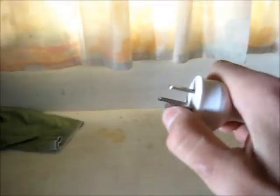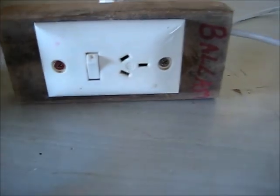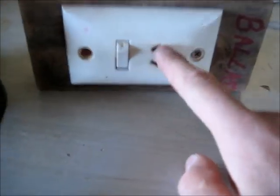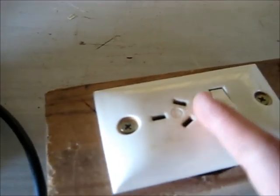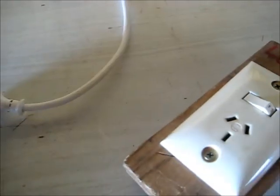All the ballast is, it's just two power points wired together in series. So I've got an active that goes through to my load, or through to my ballast. Active goes in here from your supply, out through your load, back through the neutral, and that becomes the active on this power point, which goes through your load, and neutral just goes straight back to your line. Earth is hooked up all together, so it's very important to hook earth up as well.